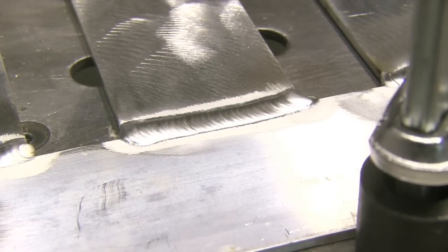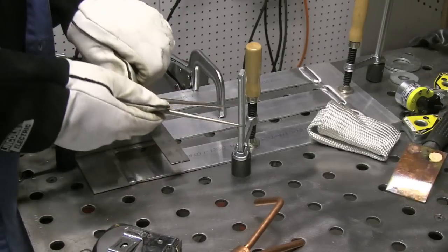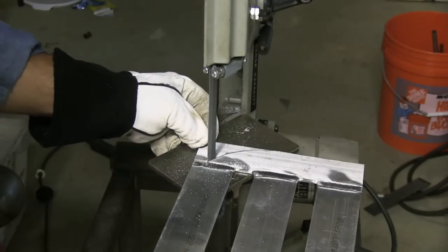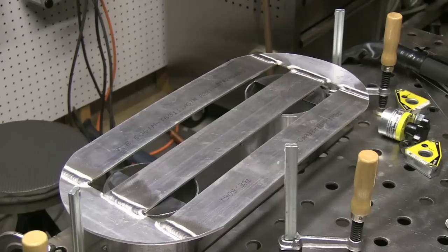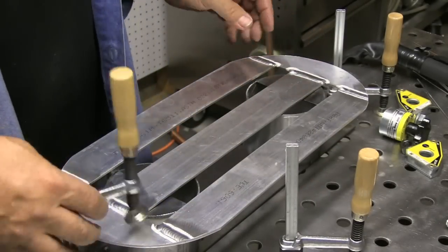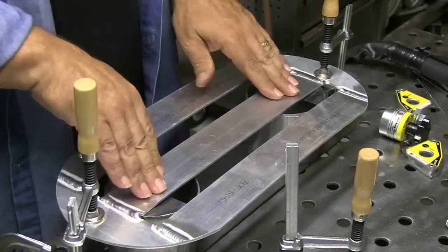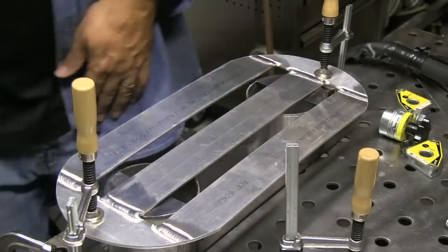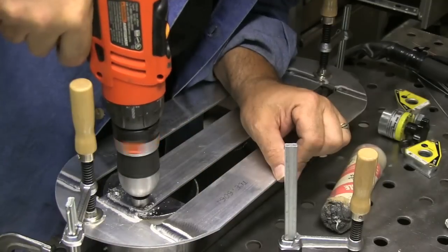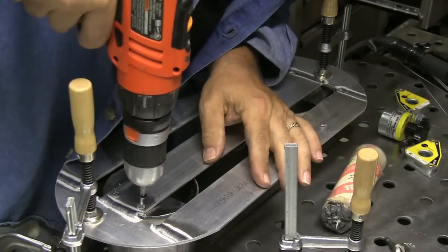Each ripple in the puddle is a freeze line, so there are a lot more of them because I added rod much more frequently. Now it's time to mark some radius cuts using a set of dividers, then cut it real quick using the porta-band stand. Now it's time to fasten it to the steel tubing pieces — we'll match-drill some holes, get about four screws using those self-drilling stainless screws, put a little countersink in there, and using countersink head screws they go together fairly quickly.